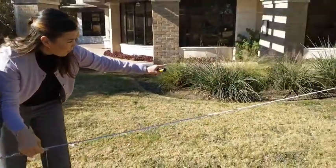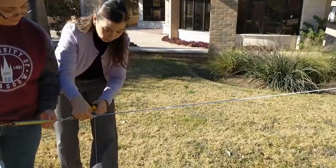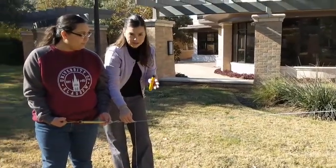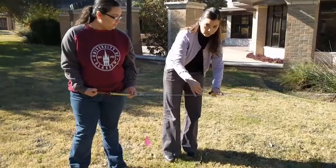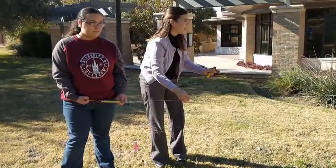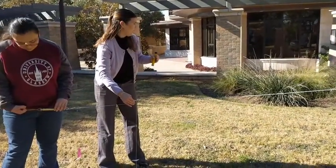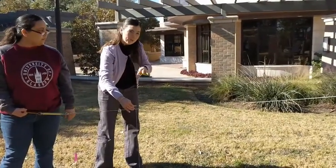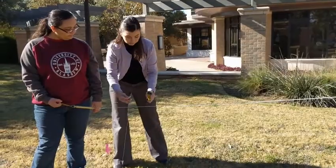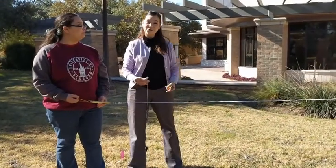So again, 25.73. I said 7.3 earlier, but 0.73 is how we're going to measure this. Does that make sense? If this were not an add tape, this is important because you might encounter one. This foot wouldn't exist, and let's say the plumb bob was over here. Then you would take this measurement, say 4.5, and you would need to remember 0.45, that it is 25 minus 0.45, so it's actually 24.55 or whatever. It's not that much harder, but when you're stressed out and pulling and being careful, it's easier to make a mistake with regular tape. With add tape, you just figure out what this is and add it to the whole number she has. So 25.73 feet. And that's how we do that.